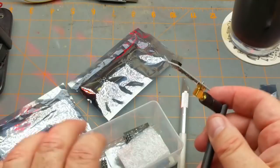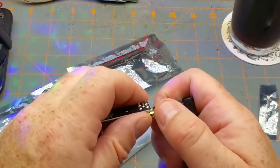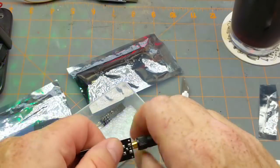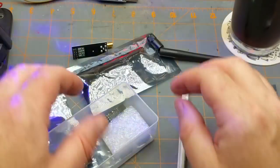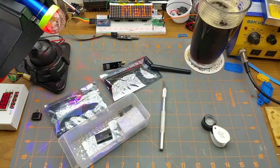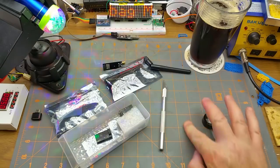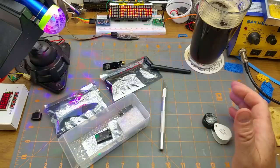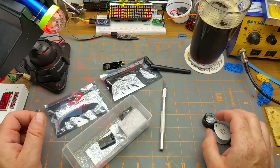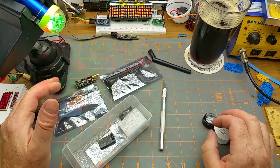Okay, I'll have to get to playing with those things one time. Those are good for remote data sending, remote controlling. They're very low latency compared to using, say, an ESP32 with Wi-Fi or an ESP8266 with its Wi-Fi, or really any kind of Wi-Fi, just because Wi-Fi has a lot more latency than this basic little serial protocol does.